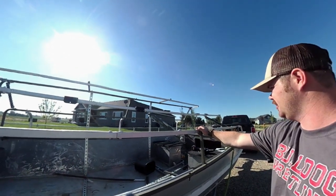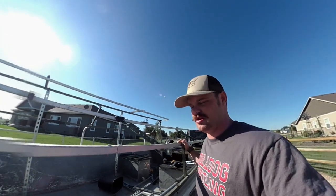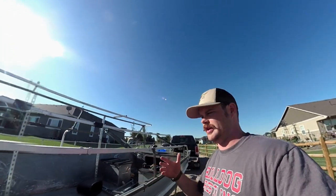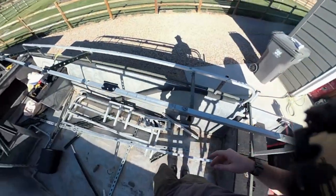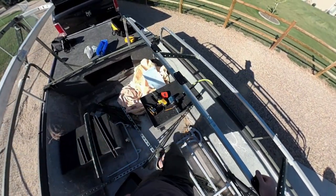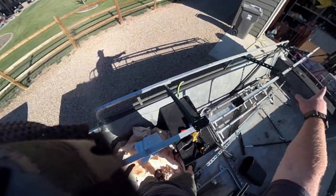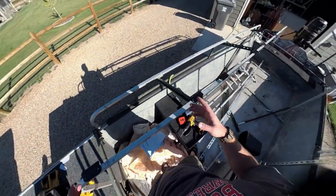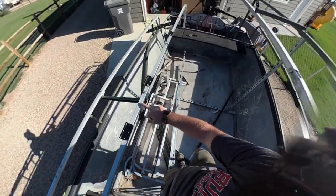The tough part about hinges is that they have to be fairly precise. So now I'm going to show you kind of what I'm doing to make sure that I get as accurate of measurements as possible. That way I'm not completely screwing this up. All right. So in my blind, I'm building four flaps. Basically what I've done is I've taken the entire length of this pole here and I have divided it into four sections. So from there, that gives me these lines.